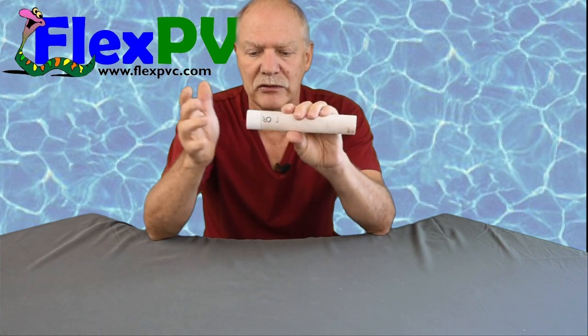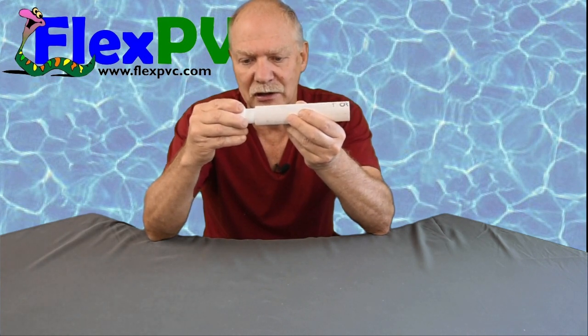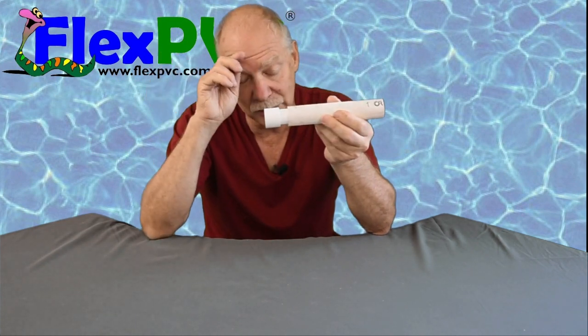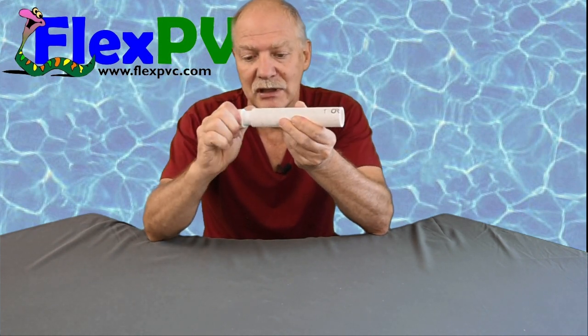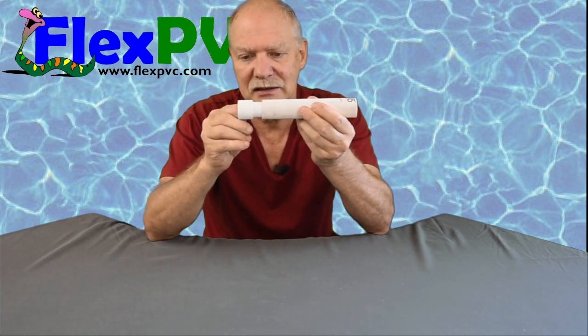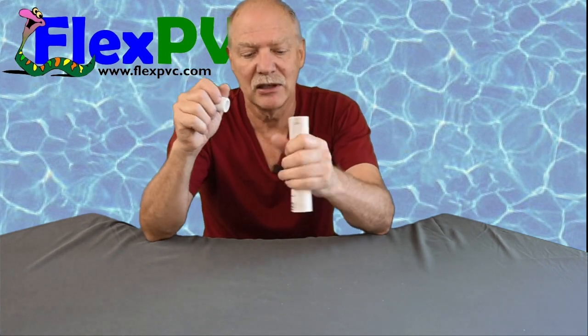Just to show you that wasn't a fluke — here's a one-inch pipe. Watch: it goes in here all the way very easily. Same piece of pipe, six inches long — this end it will start, it's a little difficult, you have to line up perfectly, but that's as far as it will go in. Once I put the glue and primer on it, it'll act as lubricant, soften the material, and go right in. But I'm showing you: same piece of one-inch pipe — this end goes all the way in easily, this end does not, using the same amount of force.